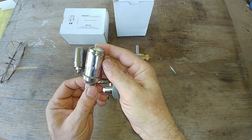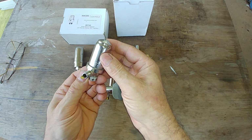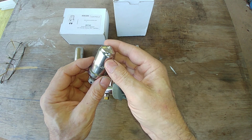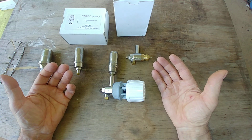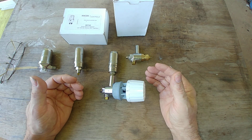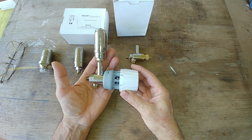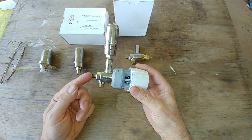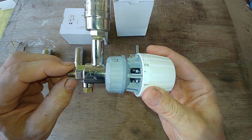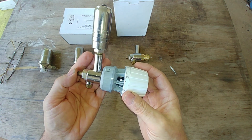This particular one, which is a #1 vent, is adjustable in how much air can escape, and so you can control the amount of heating grossly in a radiator. But if you have a situation where you have a very large radiator in a very small room, or it gets a lot of sun during the day, the room tends to overheat, then this particular device may be useful for you. So you unscrew the radiator vent and thread it in there. And you can see this one here is bent because this thing is pretty weighty and tends to distort that, so you've got to be careful.